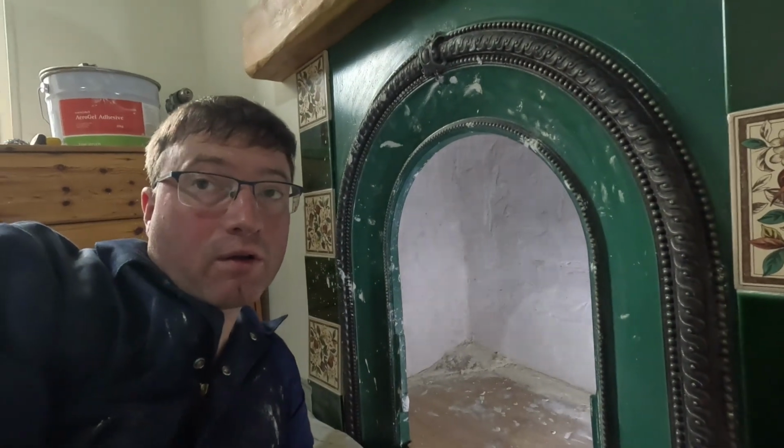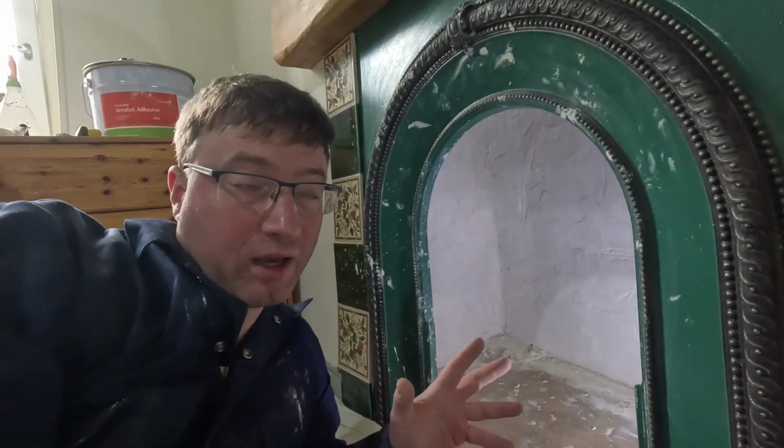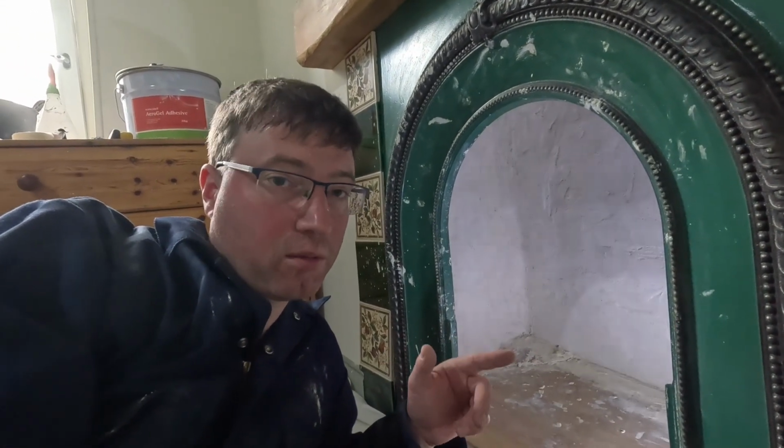So I've done the plastering of the fireplace, and it's looking pretty solid and complete. But if you press too hard on it, it indents a little bit. That's fine because it's not a functional area. I'm not going to be pressing my hand against it very often. But I think if you were doing it on a more active part of the house, then you would want to do a second layer with some sort of reinforcing.